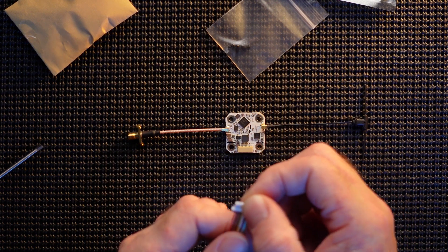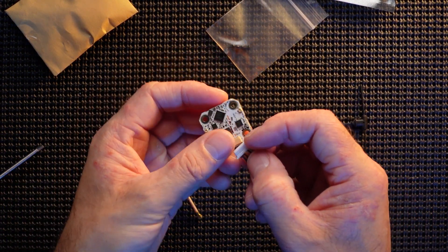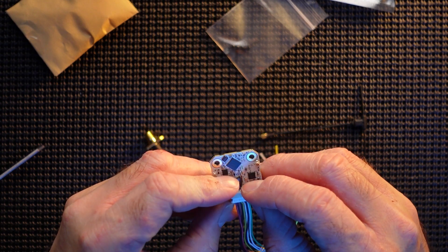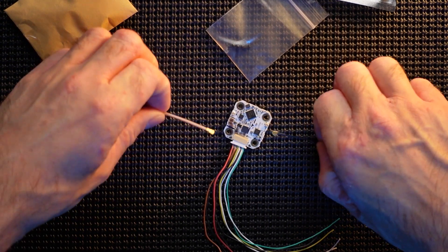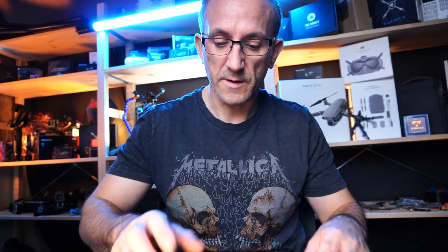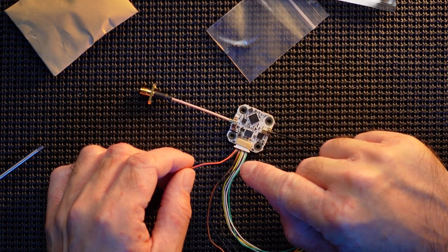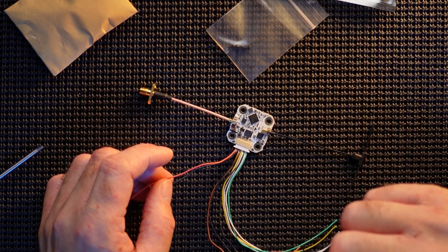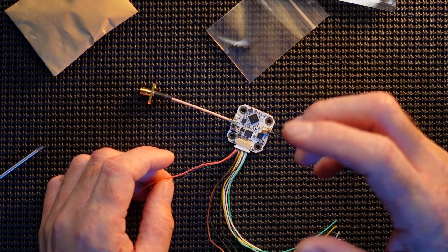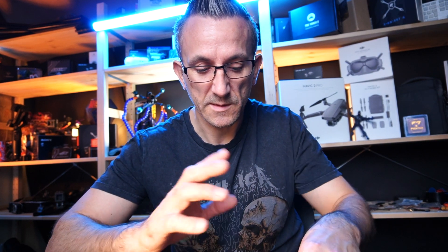Let me make sure I get that the right way around — and it is that way. Let's just plug it in loosely. These two go that side and then you've got all your cables there. You've got your main power and your main ground. Now for some reason this power cable says 5.5 volts to 36 volts. Flight controllers mainly have five volt pads, and some do have nine volt pads, but if you've only got five volt pads you're going to have to put this directly onto the battery pads, which isn't a problem because it goes to 36 volts.